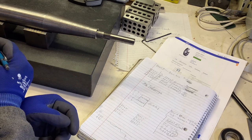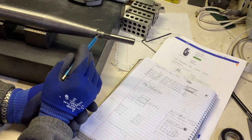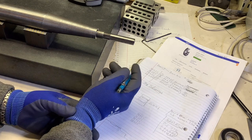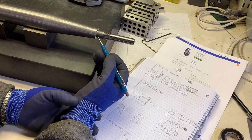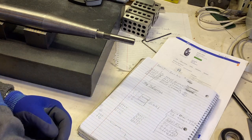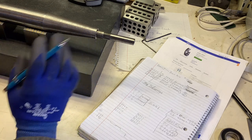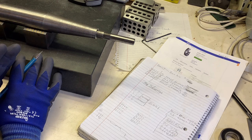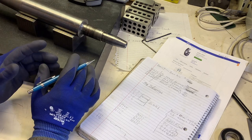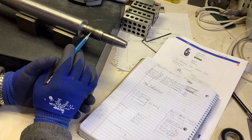The second part that had to be measured was this bearing journal here, and as it turns out it is three thousandths of an inch undersized. Clearly it's not working - this is the part that was actually clicking a few episodes back. Three thousandths of an inch is way too much clearance; it needs to be much larger. There's no other way to take on this - it's got to be reworked. But before you do that, it's pretty important to take this opportunity to look at what's going on and make sure I can re-engineer the problems so I can avoid these issues.